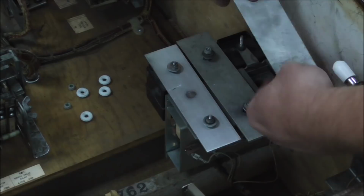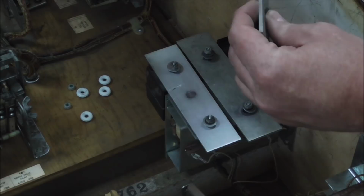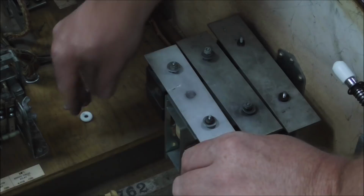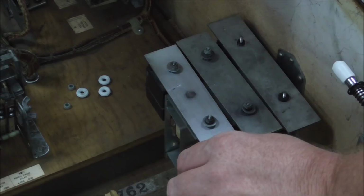If it does that, it makes it sound bad. So if you turn the little rubber thing around, where now the good piece is on the bottom, so it's got it isolated. The one on this side was pretty fine. And put it back on, you're probably good. You can also use little rubber rings, you know, from your playfield. Sometimes these are too thick, though.